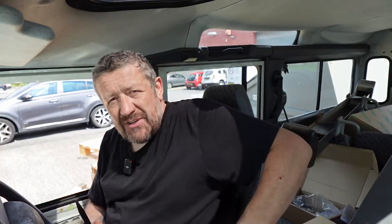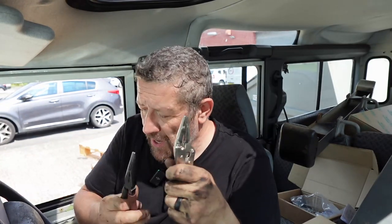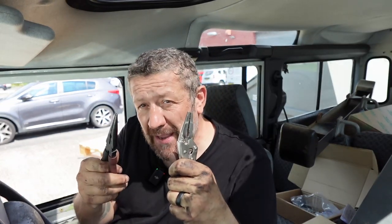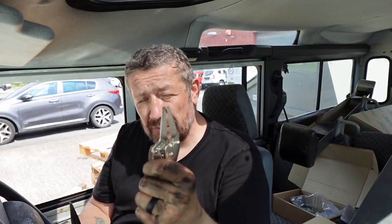He found it was much easier to use a set of long nose pliers rather than the mole grips to manipulate the spring into the top hats. The reason is that once you've clamped the spring with mole grips, you can't let off at all to manipulate and move it around. Whereas with long nose pliers, you've got enough strength in your hand — you can grip, release, move it, grip, release — and you can actually work that spring into the top hat.